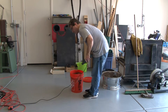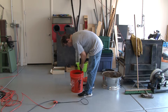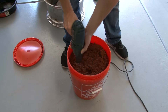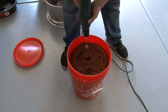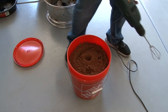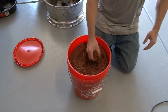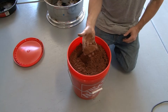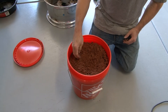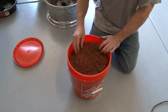I'm pretty low-tech when it comes to mulling the sand. I just use a beater that I picked up at a thrift store and a drill. The plus side is it works — I saw another YouTuber use it, tried a paint mixer, and the paint mixer just doesn't work as well. When I'm done mulling it, it has to stay together and then crumble apart. Seems really good. I love the Petrobond that I got — it's 190 mesh and works really well.